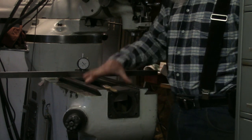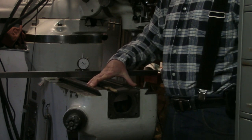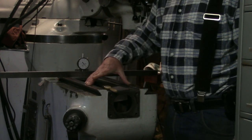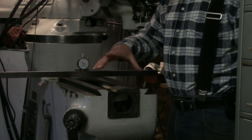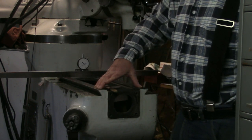I need to do some more scraping there. I've decided to stop at this point and determine, in the Z-plane, that these two surfaces are in fact in the same plane - meaning they are both parallel and flat relative to each other. Now I have this dovetail in the middle, this obstructing surface. And if you look in the Connelly book - I'll put a reference down below.